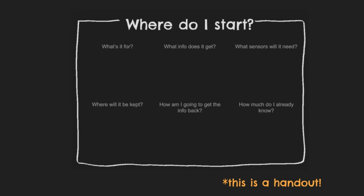So if you can see this one, it's a happy little cactus. But if we turn it round, there's a nightmare of wires. It is for monitoring my plant and it gets the information of how wet the soil is — this little prong thing here is a soil moisture sensor. I have to make sure it's a bit splash-proof and has a way of staying in the plant pot, which is just plugging into the soil.